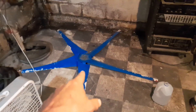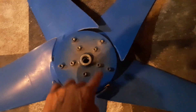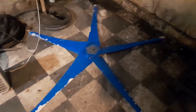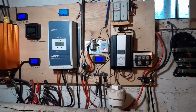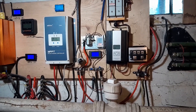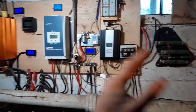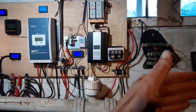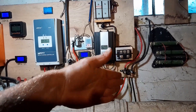So I need to move forward with this project. I gotta get all my blades off of here, pick one, re-drill new holes, and use these same blades — these are the 900 millimeter, like a KT style — and do a three-blade prop. That should have the least wind-walling, the least spinning resistance, and gain me the most RPMs. Because it's not wind-walling, that wind will be able to go through the prop instead of out and around, and keep the rudder tail in the draft, which will keep the blades into the wind and she's got to stay pointed into the wind.